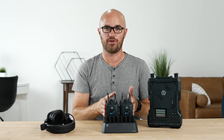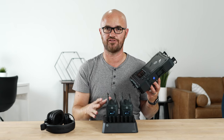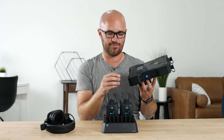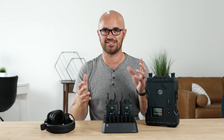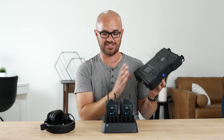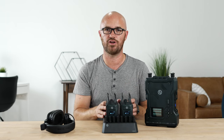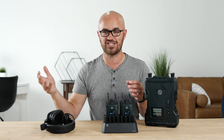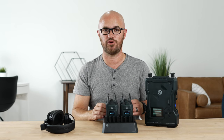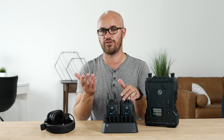This is a fully wireless comm unit, but it also has connections to work with existing popular comm systems. At our church, where we already had a wired comm unit hooked up, these can be added as additional wireless receivers for an existing network. They work with standard systems like Clear-Com and Hanson, so you can plug right into those units and use these as additional wireless receivers. That means at church, only the camera people who are roaming need wireless packs — stationary people can stay wired, avoiding interference and avoiding the need to purchase unnecessary wireless packs.